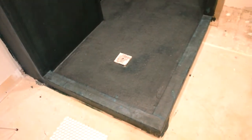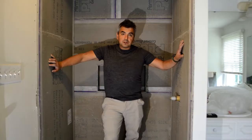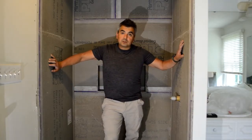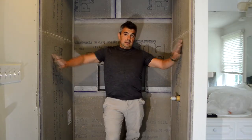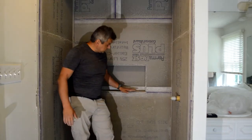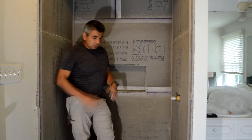So those are important things, regardless of what type of finishing that you're gonna do on the walls. If your walls are nice and safe, then you can rest assured that bathroom is gonna last for many, many more years, right? And so you don't have problems. Oh, also you have to give just a little inclination on the shelf, just a little bit, so water won't stay on these sides either, right? So once you're finished, let that dry, and then start working with your tiling process, right?